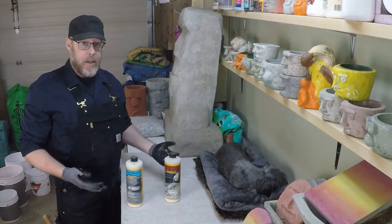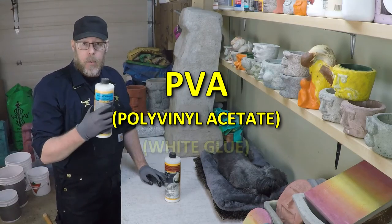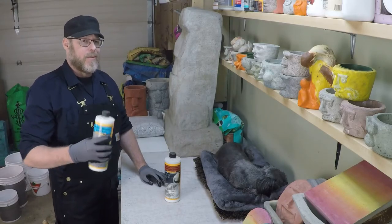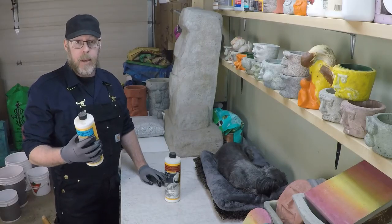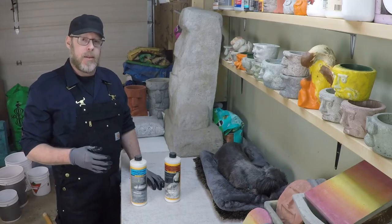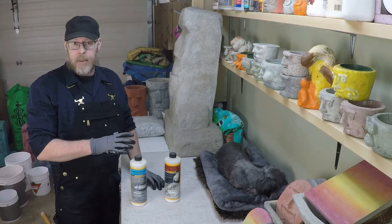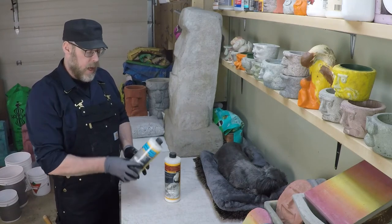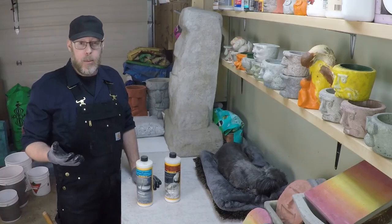So what are these and what are they used for? PVA, or polyvinyl acetate — white glue as you might know it — works in a concrete mix kind of exactly the way you'd think glue might work. You pour some in and it glues everything together, making it stronger, which is useful. It can also be used to bond new concrete to old concrete, which is why it's labeled as a bonding adhesive. It is, exactly as it sounds, a glue product.